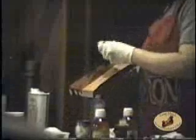So prior to this, you need to do a grain filler. There are water-based grain fillers. There are grain fillers that have mahogany pigment in them already, so you don't even have to use a neutral grain filler. And if you do go to the trouble of using a grain filler, this step goes much faster. So you can keep that in mind. I just don't have any grain filler outside of this show. They talk about it in that.